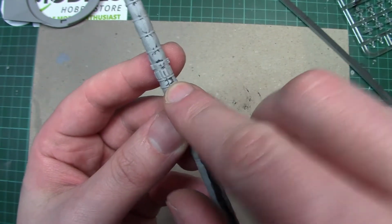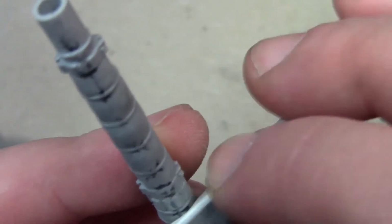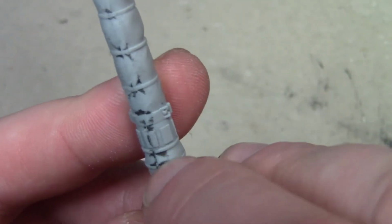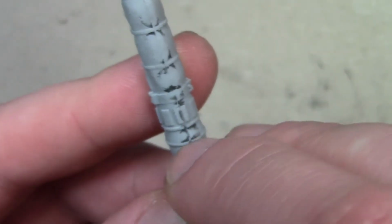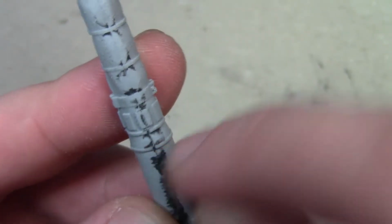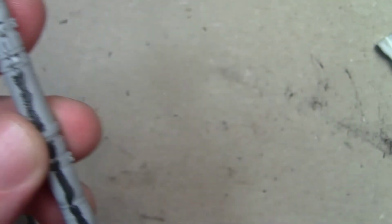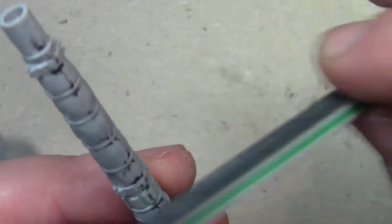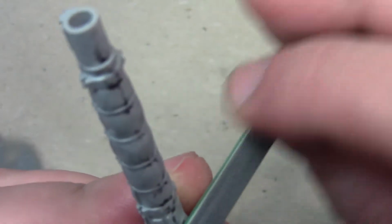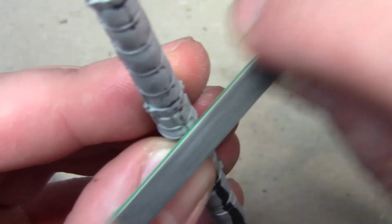I need to take care of that one properly. Just have a look there. Sand away at this, where there's loads of paint left over. Just in that corner there. Now I can't quite get to this side. I'll scratch away at that with my nail. It should disappear. But that big shadow there tells me there's a lip on this side here. So that sanding sponge is a little bit too soft to get to that corner properly. So I'm just going to very gently follow the chamfer, if I can, with a slightly firmer sanding sponge.